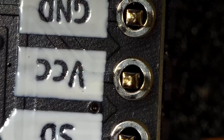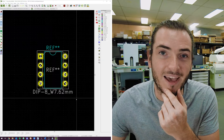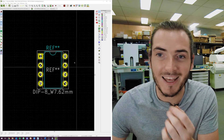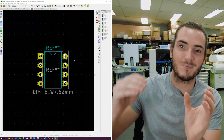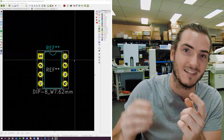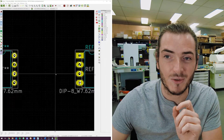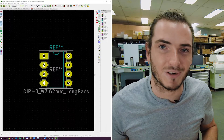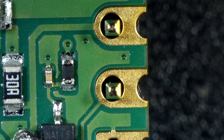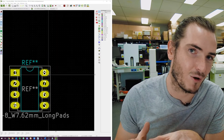Crashing the solder tip is an outcome of having regular circular soldering pads that you'd be used to hand soldering. Looking in KiCad, a pretty regular footprint for a through-hole DIP component is something we could hand solder happily, but it's hard to program into the machine — you don't want the tip to hit the pin sticking through the hole and maybe soften a connector and push it out of place. We found a lot more reliability using oval pads, like those you'd see on old Funway Dick Smith electronics kits. There's a much more generous area for the iron tip to touch the pad, and solder can then wet onto the component lead as it comes up to temperature.